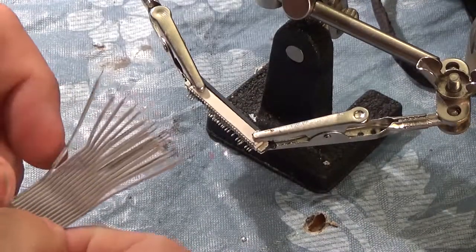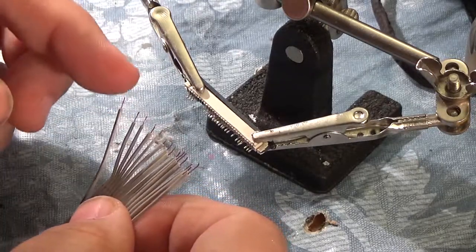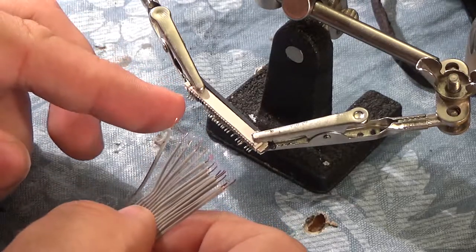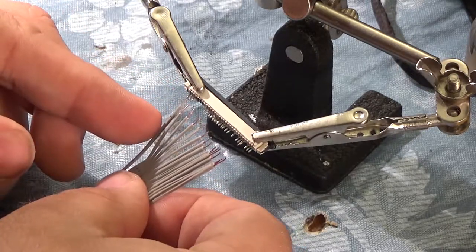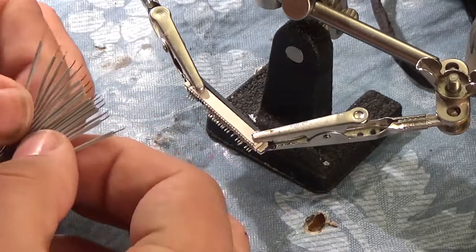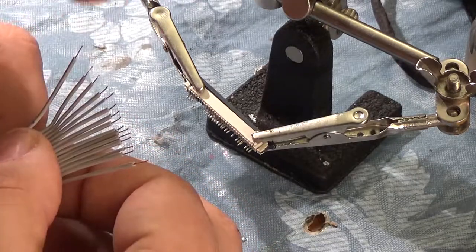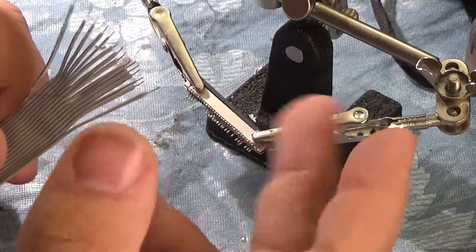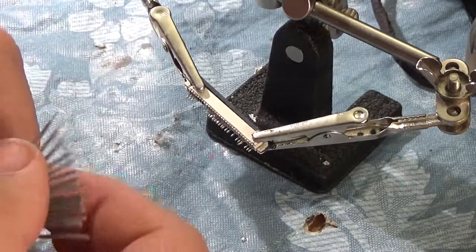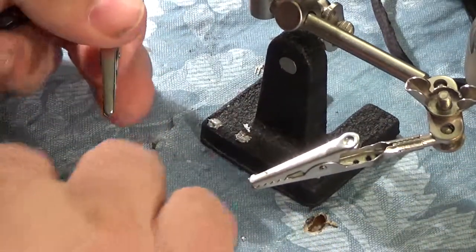All right, so I got our ribbon cable all stripped off. I think our best bet's gonna be to pre-tin these. And then these still have some solder on them from where we desoldered them. And they should just stick quite nice. I'm actually gonna need to trim these back a little bit because they're a little too long. So I think we'll tin them at this length and then use the snips to trim them down a little bit. So let's get started on that. Let's actually pull this out. It's gonna be easier to do this up here.